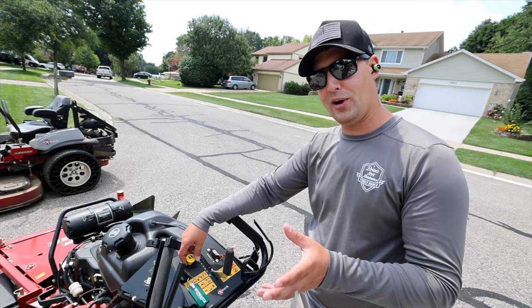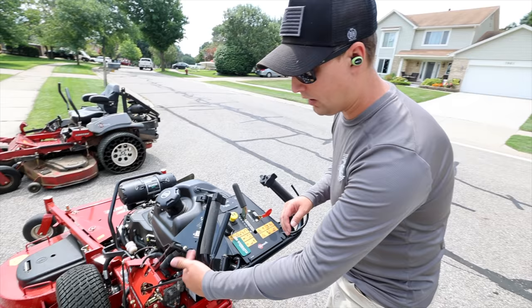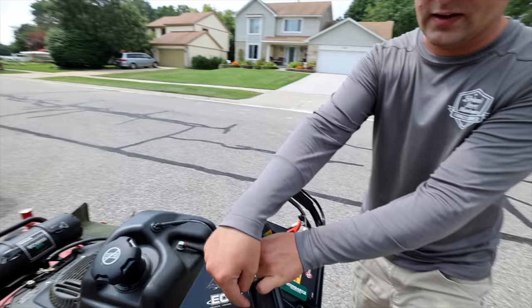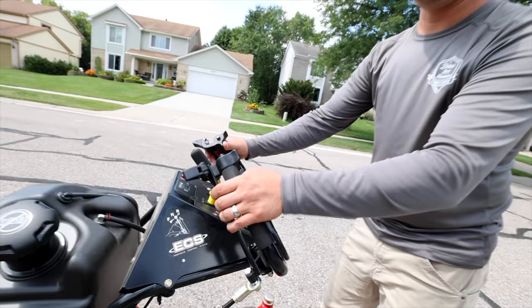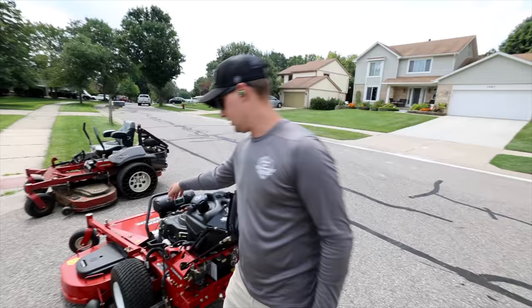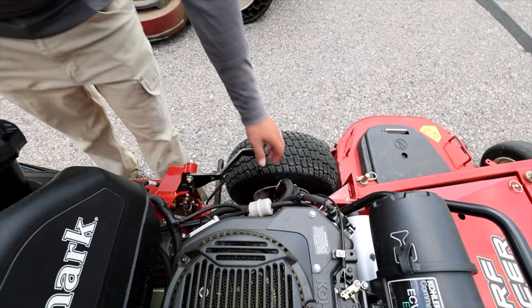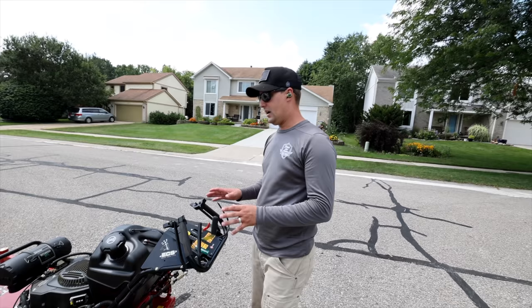This right here is typically your hydrostatic or gear drive. A hydro means you punch this lever forward and it opens up the hydro grip. See how it's fully expanded? If I shift this down you're going to see it won't expand as much — that's the default. Once you release the parking brake, you've also got your throttle and your hour meter. When approaching a walk-behind, the first thing to find is your parking brake — sometimes it locks up the gears or hydro, sometimes it's just a simple tire brake.